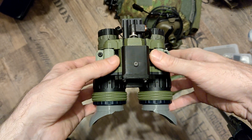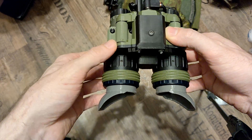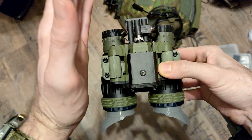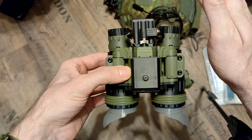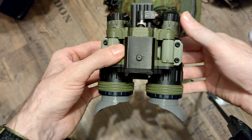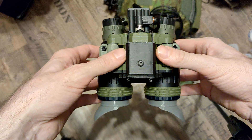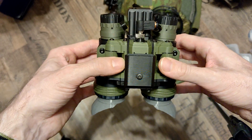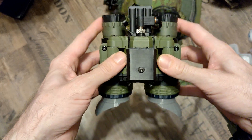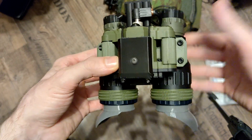When I had the cameras parallel, the pictures simply wouldn't align and merge in the viewfinder. Of course, doing no research at all, I had to discover collimation myself — merging two pictures so your brain can form a stereoscopic view. I experimented and found that bending each camera outward at around 6 to 8 degrees made the pictures align. So I designed two lens holders with 4 degrees each — not one at 8 and one straight — and it perfectly worked. I also had to lift the left lens 1 degree up.